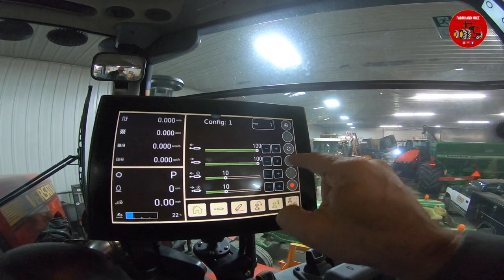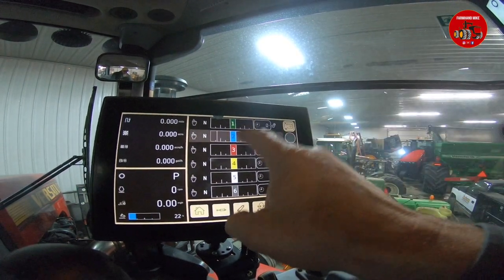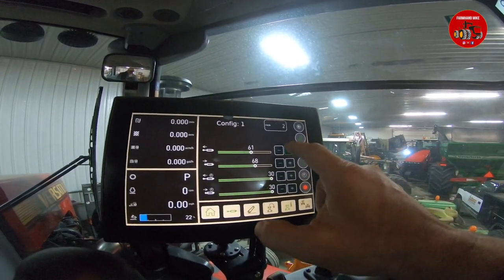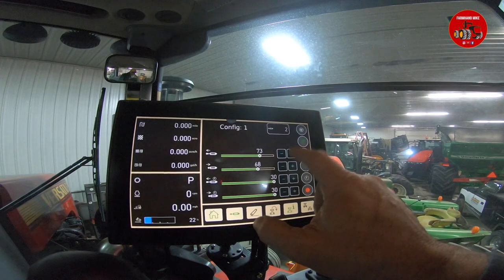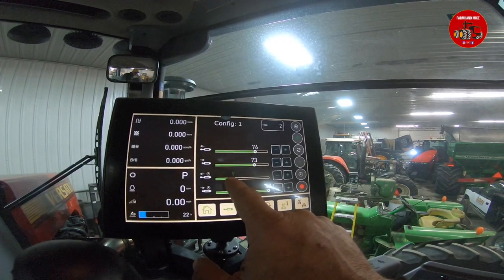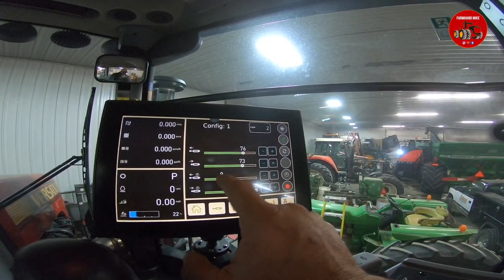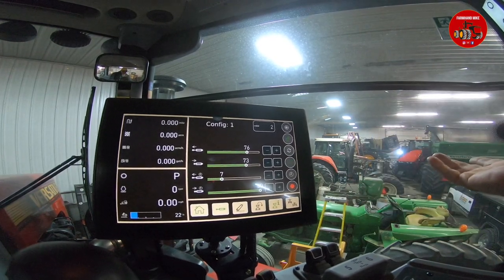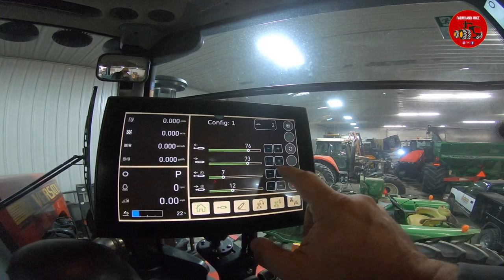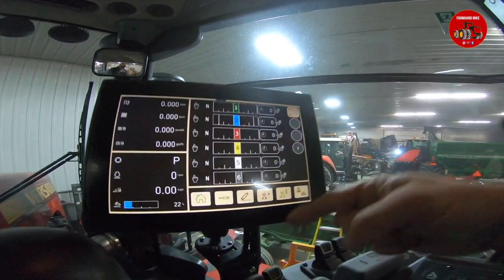I'll put her back on manual. Once that's done, we've got that valve set where we want it. We can just go back and do the same for valve number two, and so on — adjust the flow for down or up. These are set for 30 seconds on that timer. I normally, if it takes say five seconds to raise or lower your implement, just go a couple seconds extra just in case. You can do it by dragging or by the plus and minus buttons. Pretty simple.